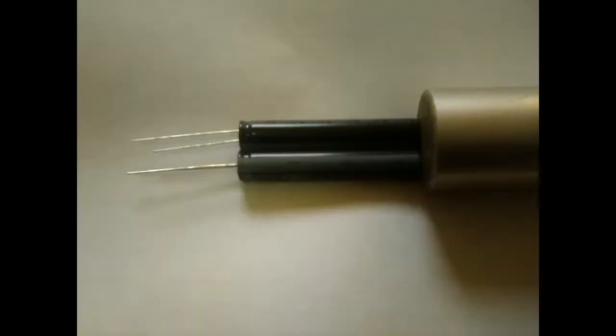And I got to thinking, Hayseed Hamfest makes the capacitors there, and all they are is cans and ends that they have somebody custom make for them. And then they solder regular capacitors inside. So I figured there had to be something out there. So I went on DigiKey and started looking and found that there's a whole series of capacitors that are only 10 millimeters in diameter. So two of those fit in there fine. Two of those, and then the little 25, there'll be no trouble at all putting those in.